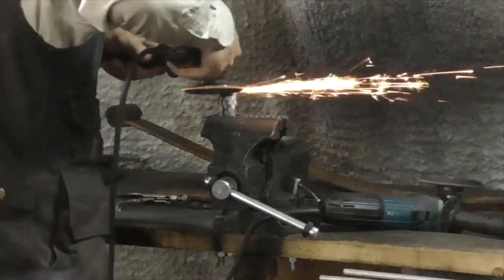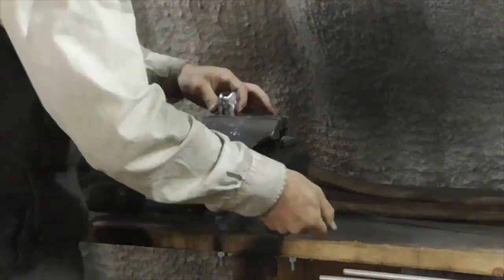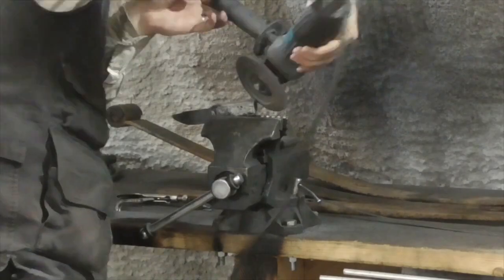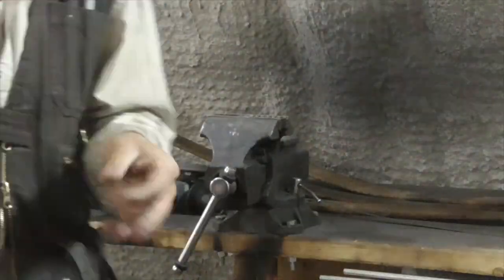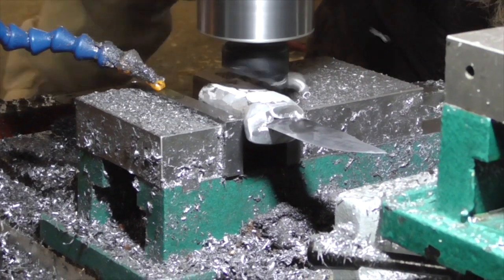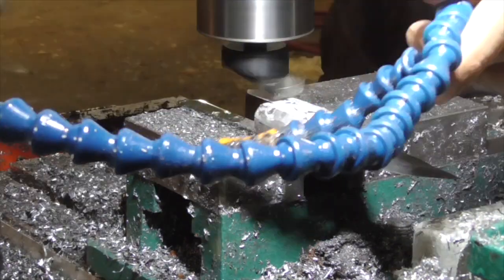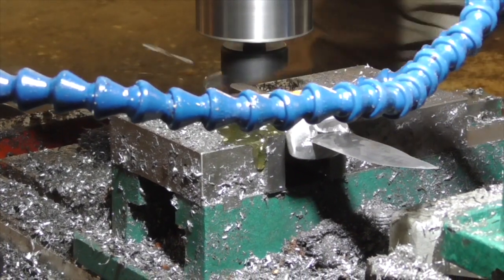The mold didn't fill out very well. It looked like the aluminum had flowed down one side of the tang and then around it, but didn't quite fully join on the other side, and there was a void at the top of the casting that functionally made the handle shorter than it was supposed to be and left part of the tang sticking out.